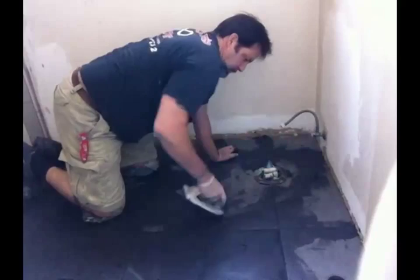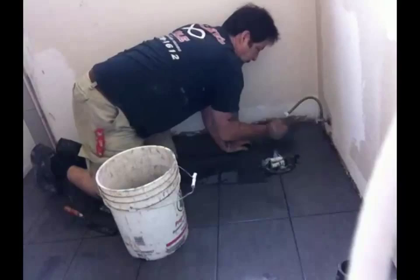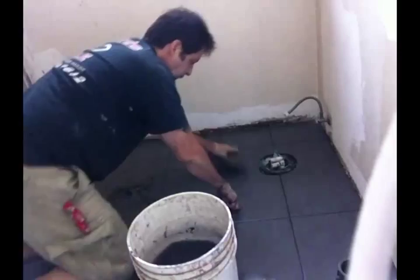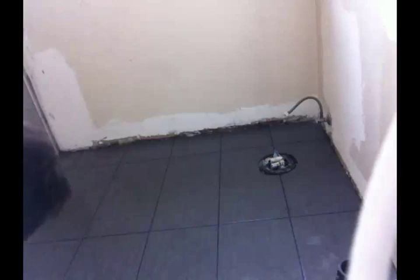Now I'm washing the floor. Scrub it up — make sure all the joints are nice and even, going in with my fingers. Flip the sponge once, flip it twice. Don't drag along too much — go diagonal. Use clean water; when it gets dirty, get some clean water. Grouting keeps the joints all nice and even. Sometimes the floor needs a second wash-off.